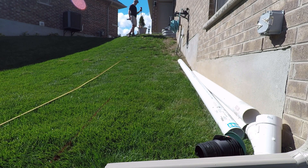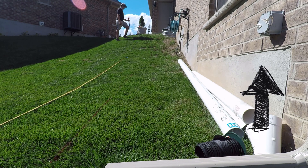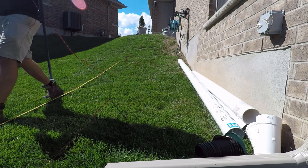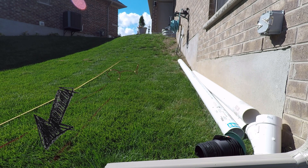A very rudimentary way of measuring the elevation for these specific steps would be looking at the bricks on the house and measuring up from a zero point — assuming that the house was built level and the bricks were laid level. But that's not specifically accurate, so what we will be using is this high precision altimeter. We're going to set a zero point at the base of these steps where the final step will step down to our initial step — that will be ground level, our zero point.